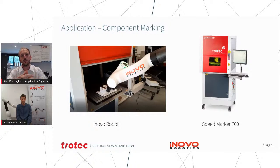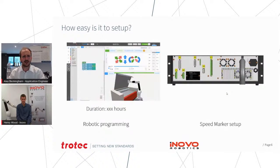So the first application we have is a component marking application. And generally what we find is for something like this, we're looking at a machine like a SpeedMarker. This is a galvo type laser, a laser where the actual laser head is stationary, and it uses a mirror to very quickly move the beam across the part and have very quick marking. So again, it's something where you'll be loading and unloading quite repetitively and quickly, and so it's a good application for this kind of technology. A big question you will have is how easy is it to set up? So I'm going to pass back to Henry, who will hopefully give us a bit of information about the process we went through to set up.